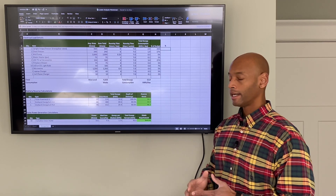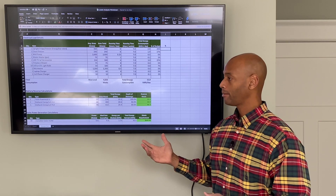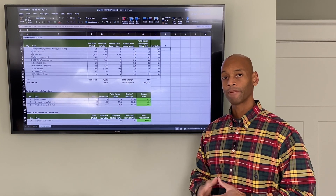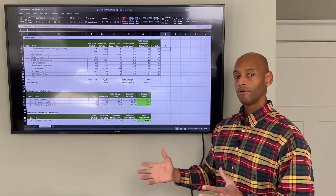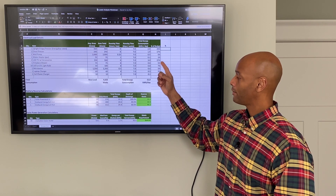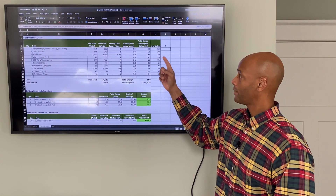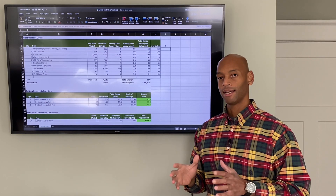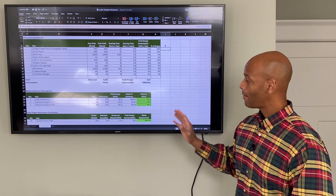What this allows you to do is: if energy becomes scarce — say the grid is down and it's been overcast all week so solar panels can't keep up — you can look at where you can cut back to reclaim usable energy. In this example, the two televisions consume 27 percent of the critical load energy budget, so cutting both TVs off gets you one more full day of running the refrigerator and freezer. That's why having the energy budget is so important — it shows exactly where energy is being spent and how much you can store.